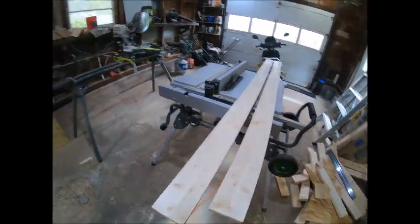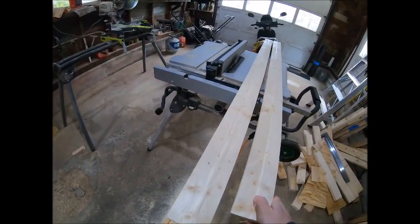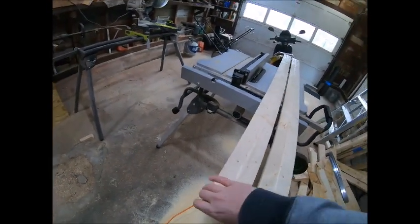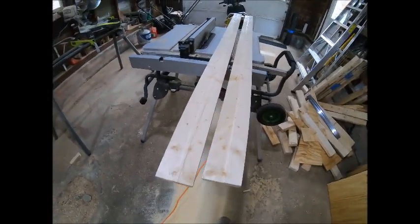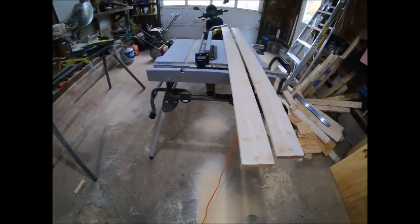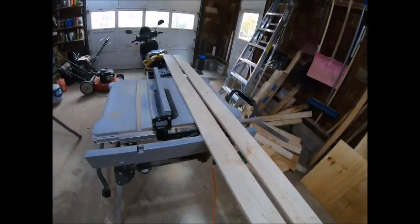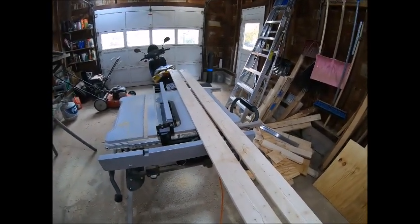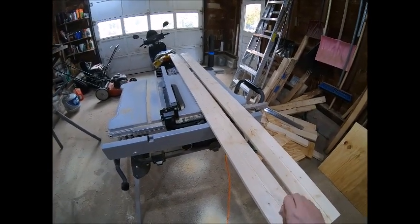Welcome back. So onto the shed build again. Making the trim boards. Ripped just a 2x4 in half on the table saw. Only means I don't have a bandsaw. One downfall of doing this though is if you're off by just a 1/16 of an inch, you get that 1/16 of an inch mark. So there's that, but that shouldn't make much difference considering what this actually is.